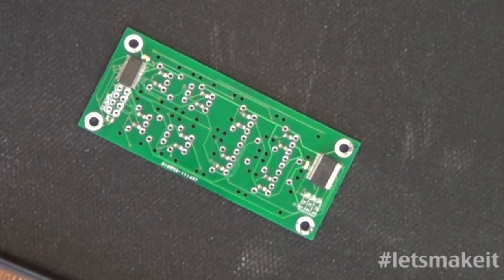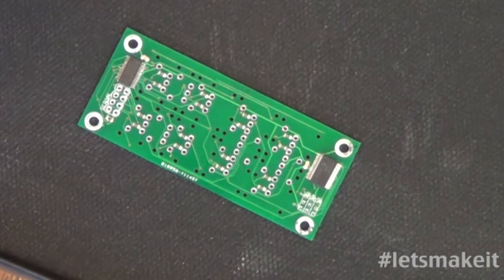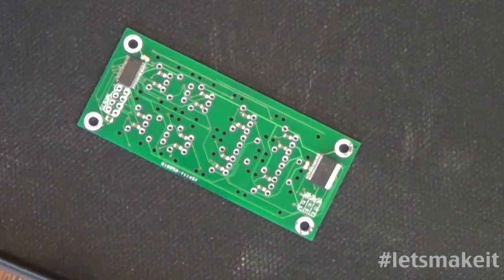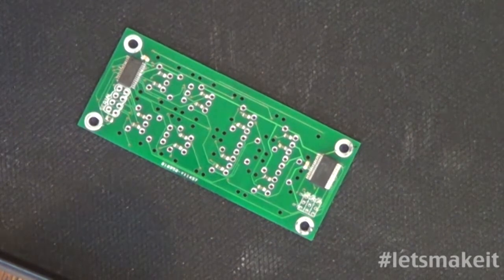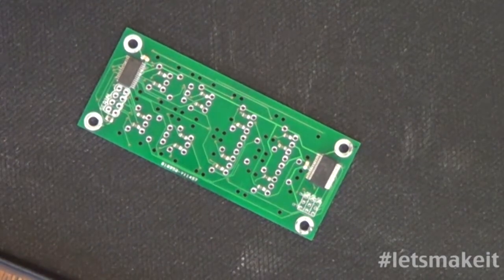So I don't let it cool down really long before I take it off of here. I'll probably let it get down into the 300s or so, so that the solder is a little more solid, and then I pull it off. And I actually put it on the table because I don't like the parts being this hot this long. So current temperature is 419, so we'll wait for a minute or so and then we'll yank it off.